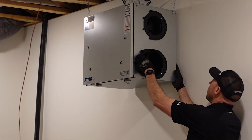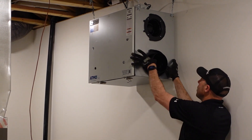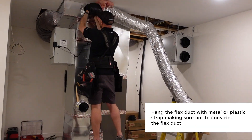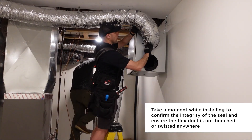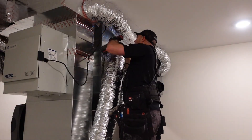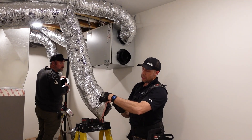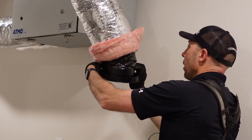One of the smart things Fantech did was design it so you can slide these collars into place with the unit already up on the wall and then secure them after — it locks in, and then a couple of screws to secure it so it doesn't pop back off. So I can actually make up all my air connections on the ground if I choose, then work my way up and around. I've run the flex long intentionally so I don't obstruct the 90 degree, then bunch up the end to make that smooth 90 without excess.